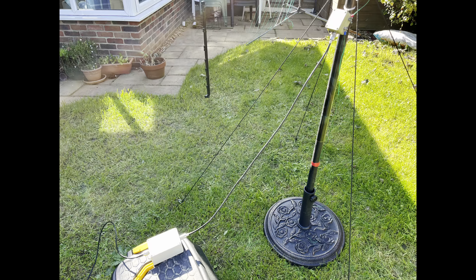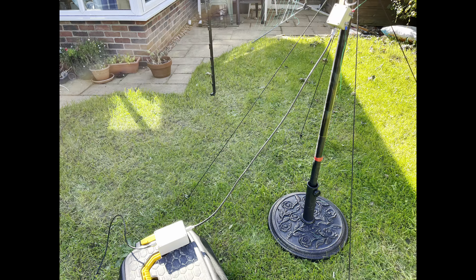I ran the coax - about 3 feet or 90 centimetres of RG58. I tried to run it away from the bottom leg as much as I could, at about a 45 degree angle, because you don't want it running basically parallel with the bottom leg or it'll just couple with it. I put a line isolator common mode choke at the end and plugged the analyser into that - that's how I measured the SWR. Then it was time to hook the thing up and get on the air.